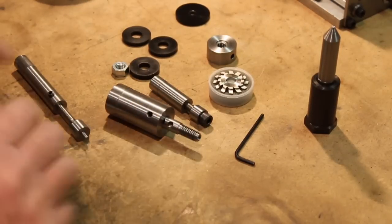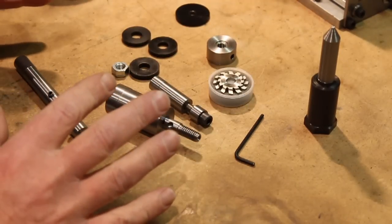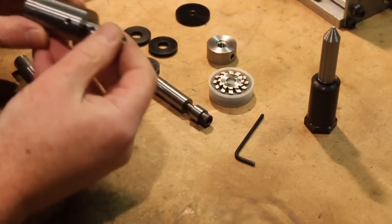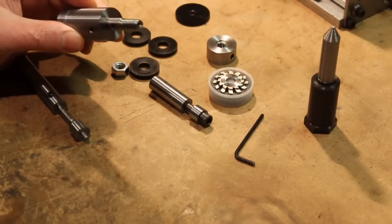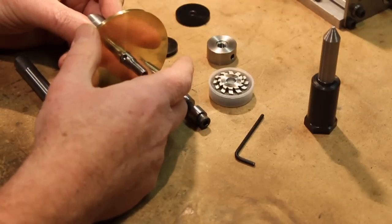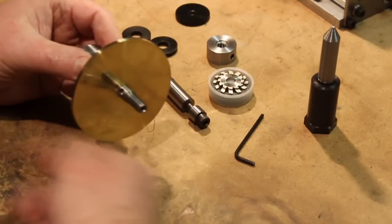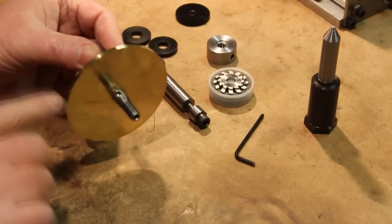Before you can begin making gears you have to make some tooling — some arbors and such — because everyone's gears are different, so there really aren't commercially available parts to do these kinds of things. For example, this is an arbor I made to hold gears that have a three-eighths inch diameter shaft. It had to be made so that a gear blank would fit exactly on this shaft. It's used for turning the gear on the lathe to get it down to the correct size, and later it will be mounted on the milling machine in the rotary table to cut the teeth.